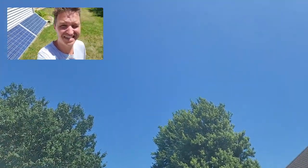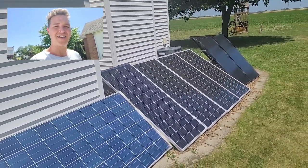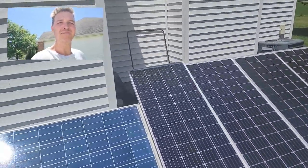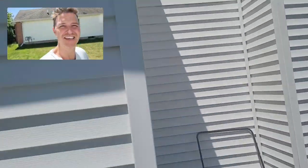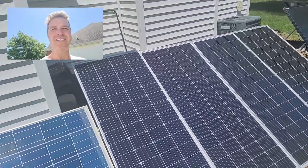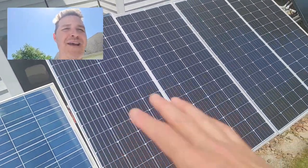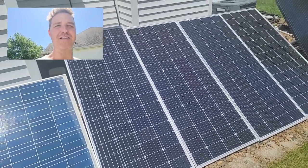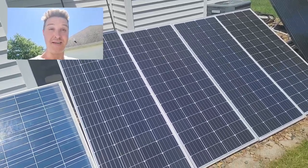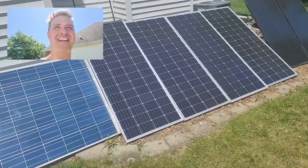It is now the next day. It's another beautiful, no-cloud day and my panels are still sitting exactly the way they were yesterday. It's two o'clock in the afternoon and I'm just starting to get a little bit of shade on the panels from my roof. That's kind of the downfall of having these panels at such a low angle — they sit back farther, so the shade hits them earlier in the day. Since these panels are in series, once that shade starts, it loses a lot of electricity. We're going to go inside and check our numbers to see if it was worth putting these at a lower angle.